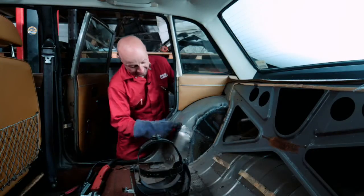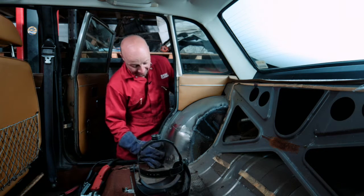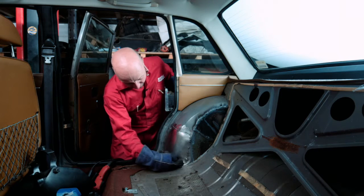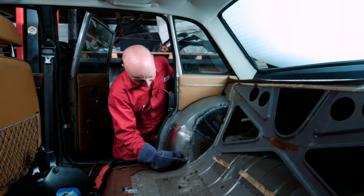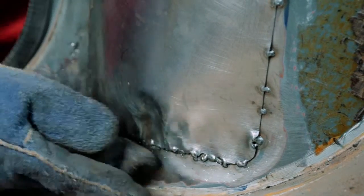In this case it's so well held here, here, here and here it's not going to go anywhere. It's not going to deform badly, and afterwards I would go in with a hammer and dolly and dress that up so it's all in the correct shape. You may be able to see that there's some distortion where I've been knocking the panel and the metal behind to fit each other, but there is a need to do that and we can dress this up afterwards once it's all in.